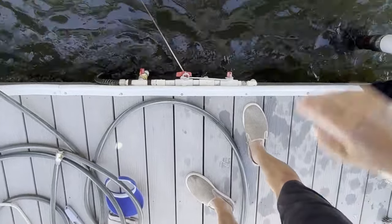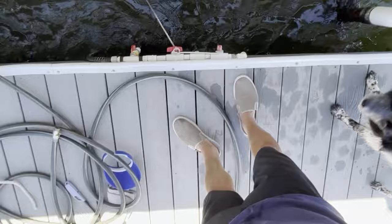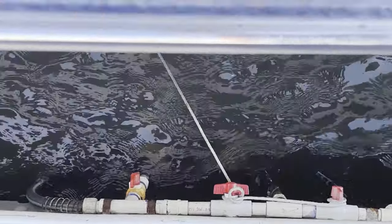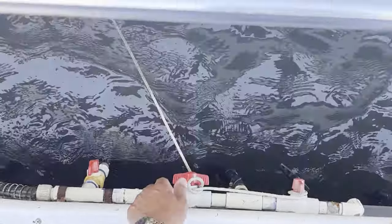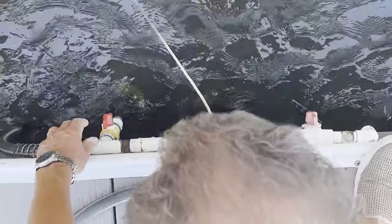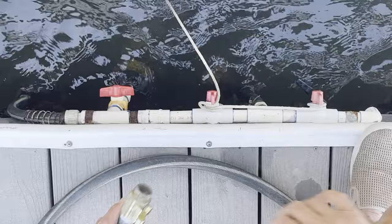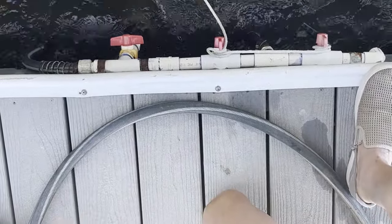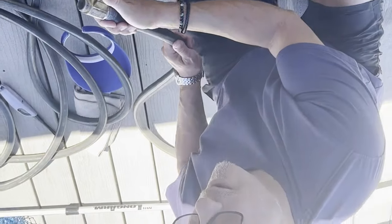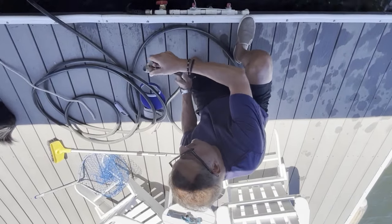Guess what — if we walked up to the house now and hung out or went to bed, we'd be spewing city water into the lagoon right now, and it would be a huge amount of water wastage. So what we want to do is come down here and shut off the water that fills the cylinder, then shut off the main valve. We should also release the pressure in the hose — because the hose is full of water, and especially with hot sun it can expand that water and damage the hose. So we just release the excess pressure.